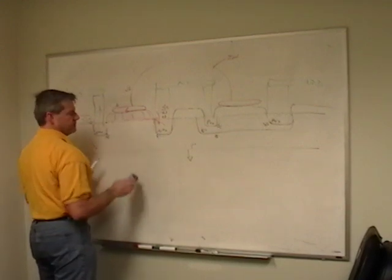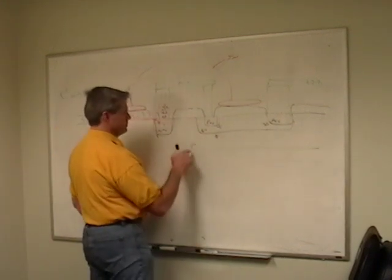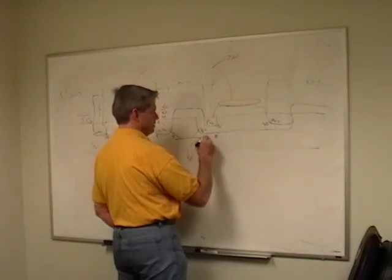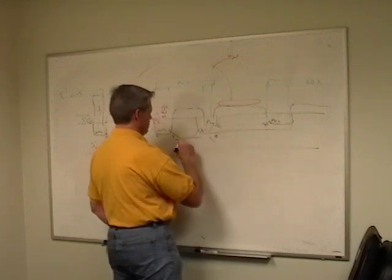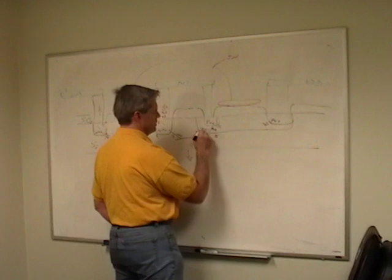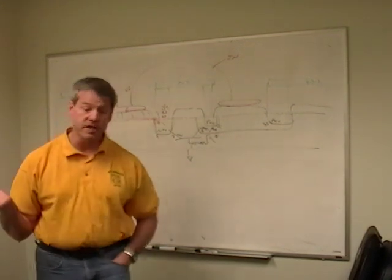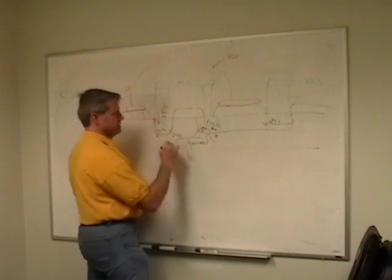Okay, so we've talked about field strengths. Now there's another situation you can get into here. Remember we drew two diodes back to back earlier, and we called it a transistor? And there's actually another transistor here. And this one's an NPN. And this one's a PNP. And this material has some inherent resistance, right? And you can get a situation where, because your chip heats up, maybe, there's always some leakage current running back and forth here, because there's differences in potential between these different spots.